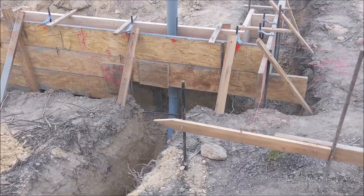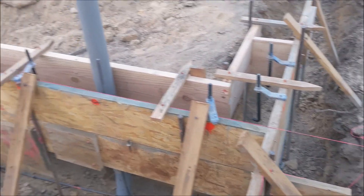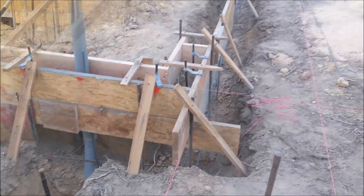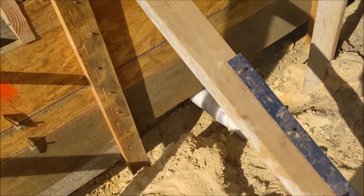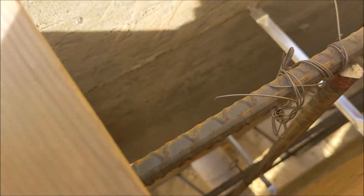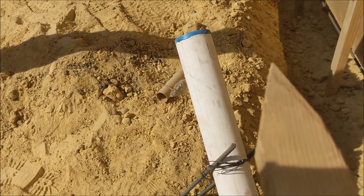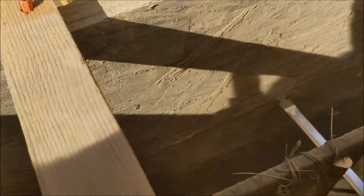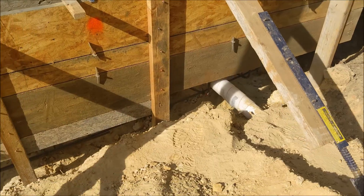Here's the electrical in the corner of the garage — that's going to be a conduit sweep where the electrical is going to go in. That goes right through the footing, and next to that is a ground rod to make sure it's grounded. In addition, there's plumbing — this is the sewage pipe going down to the septic system. It goes under the footing, wrapped in foam and water tested to make sure it doesn't leak. The building inspector wants to check that full of water before he signs off on all of the steel and formwork before you pour.